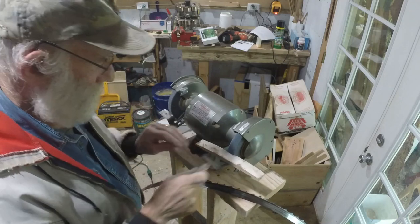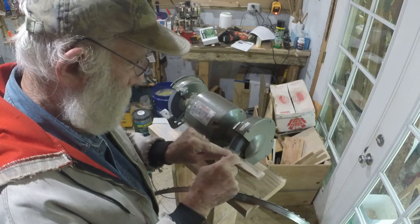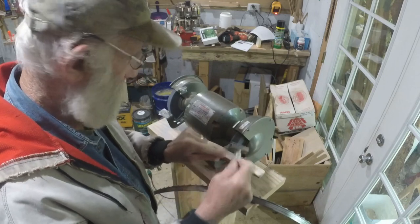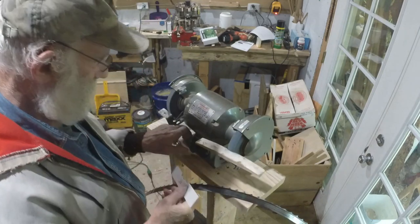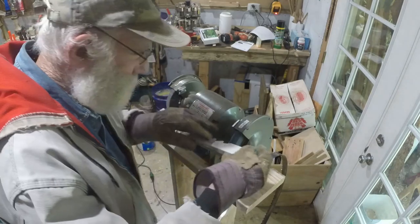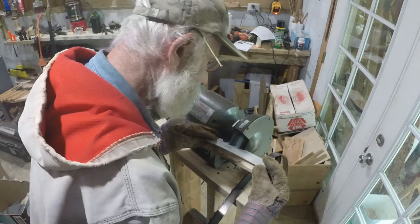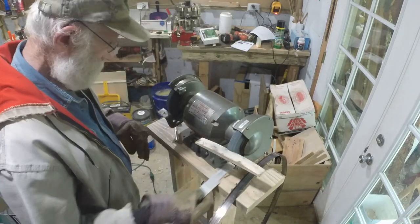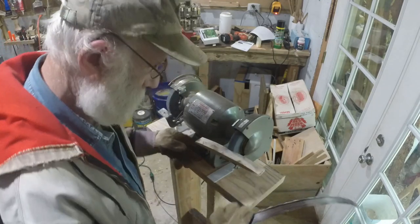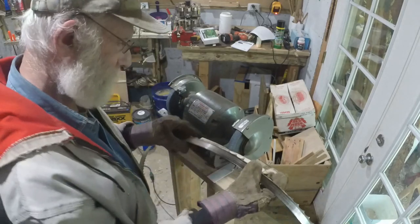I next went to the bench grinder, shaped my fine wheel with a $10 Amazon diamond wheel shaper, made a template out of plastic from the blade and used that to rough set the wheel and checked it with an actual blade. The little rest is about 10 degrees to the wheel, the same as the teeth.